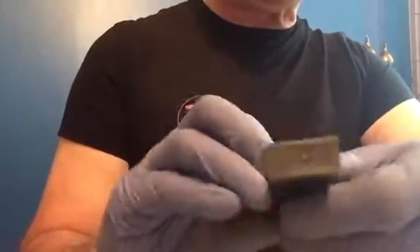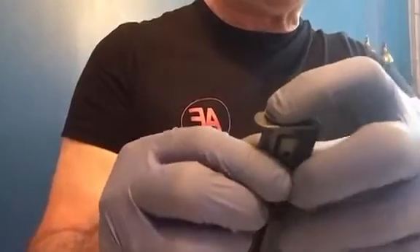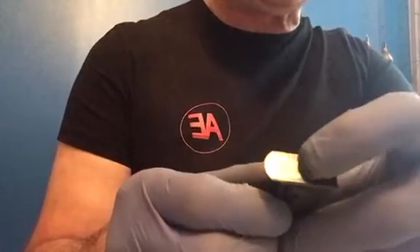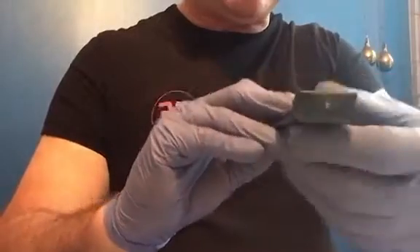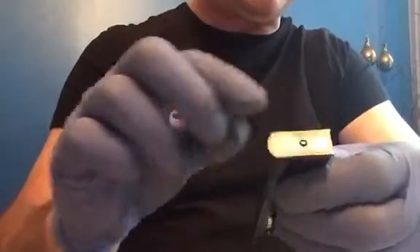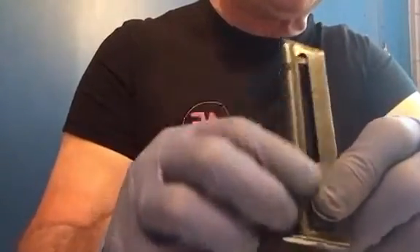When I went to put it back together, the spring was so weak that the internal floor plate with the dimple just kept wanting to back up into here. It was very hard to hold it in place and get the external floor plate on. And then once I did, the internal plate with the dimple did not want to pop into place to lock it. What I had to do was take this piece of coat hanger, jam it in, make sure the back of the floor plate was up, then slide this on — you've got to lift it up a bit because it catches the internal floor plate. Finally got it in place, had to go in again and use this to push that plate down so it would lock in place. The spring in here just does not have enough power to do what you need it to do.